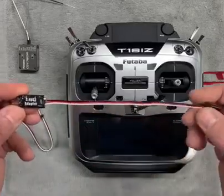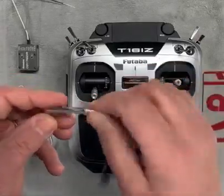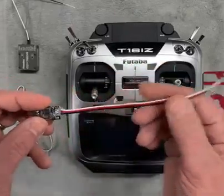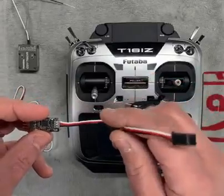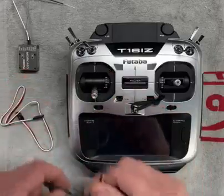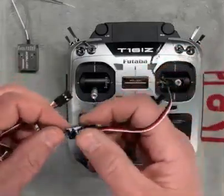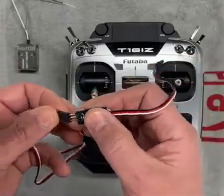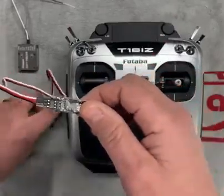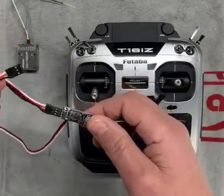I just wanted to show a picture of the adapter. As you can see, it's a small board, looks real nice, high quality. You will note one end has a lead soldered to it. It's worth noting this is the end that goes into the CGY760. On the other end they have pins, and they have included an extension cable. Just be mindful of the polarity when you connect it. I'll probably go ahead and do some heat shrink over this to make it a little bit more permanent. And then the other end goes into, in my case, the Hobbywing 130 ESC.